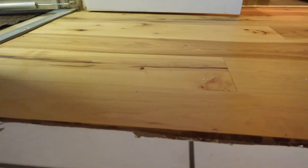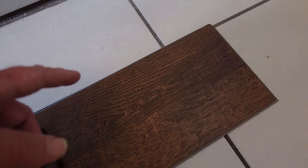First things first, we don't make anything easy around here. We're going to be installing it with no molding, right up to our wood flooring. Now everybody's going to say expansion, expansion, expansion. But vinyl number one doesn't expand very much. And number two, we're putting the short ends of the boards up against this wood flooring here. The short ends of any flooring expand much, much less than the long ends of the board. These ends here, they hardly expand at all — it doesn't matter if you're in wood or laminate. They expand much less than the long part of the board. And I've been doing this for 30 years and it's never let me down.